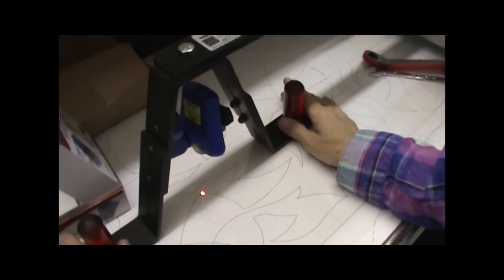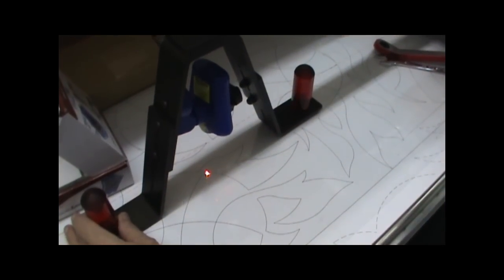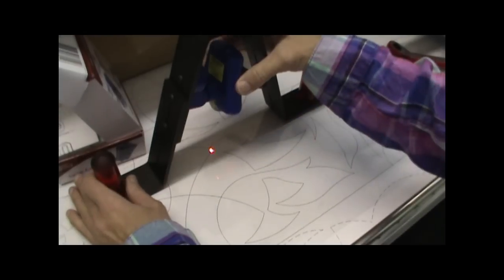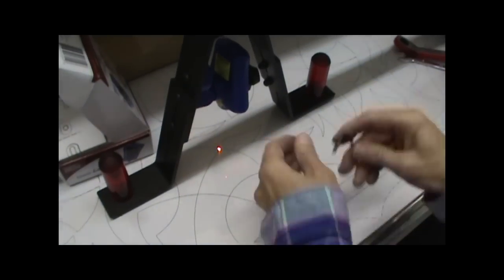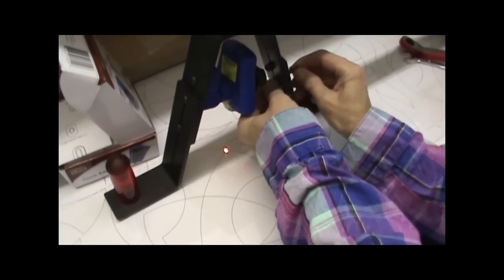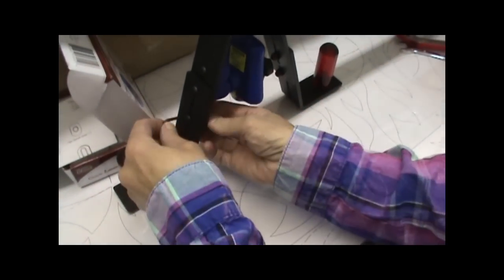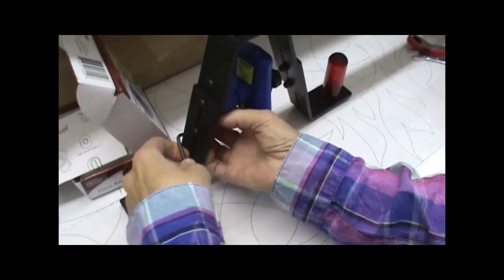Again, I'm going to make sure that my handles are where I want them, that my channel locks, I'll turn those off, and then I'll see that I can follow my line here. My laser's not moving, it's steady, and so now I'm going to tighten my side leg bolts. Remember, we didn't tighten those before. And again, I'm going to tighten those using the hex tool on this side, and then I'll do the same on this side so that my legs are not going to move either.